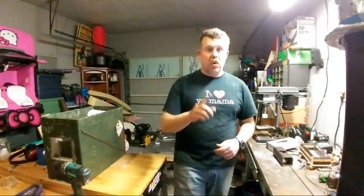Once I can start using coal, it requires air, and then this is going to be utilizing a forced air ribbon burner. I also need to be able to get air to this as well. So I'm going to create this box to where it's going to be one or the other, to either send air to my charcoal forge or send air to my gas forge, or both, right? I want to be able to have air going strictly to my gas forge, or strictly to my charcoal forge, or air going to both forges at the same time, if for whatever reason I need to use gas and charcoal or coal at the same time. I don't foresee that happening, but I'm going to make it. That way I can use one blower for multiple things.